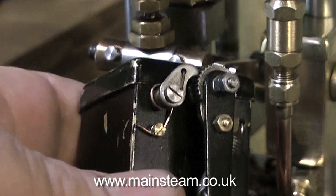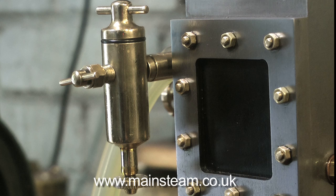These are the most common type of mechanical lubricator: the one that uses a ratchet wheel with a hardened pawl. This drives a small oil pump inside. And then of course there's a normal displacement lubricator. This is one that's fitted with a valve to regulate the oil supply. They work by steam actually condensing inside the unit, which forces the oil — or displaces the oil — into the steam line.